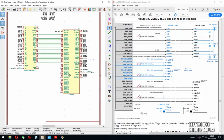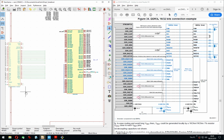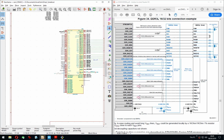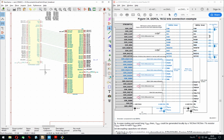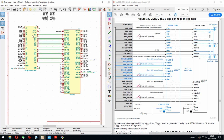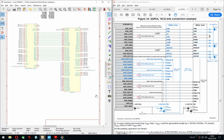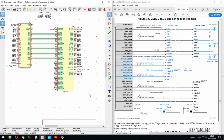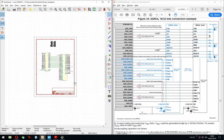So just in case you are not aware, normally when you select and start dragging, as you can see, the traces get disconnected, but while you're dragging, you can press tab and that actually keeps them attached. So that's really useful if you're in this situation, if I had to redraw everything, or actually I would move it to the right and they would end up being in the middle of the pin. So that's really annoying. And this is a nice quick way to fix that. So yeah, there's a little trick for you.